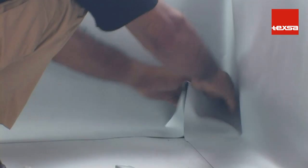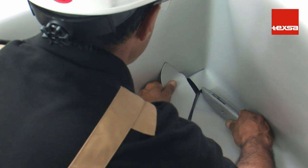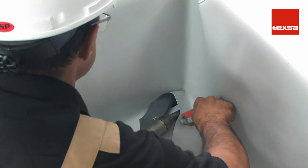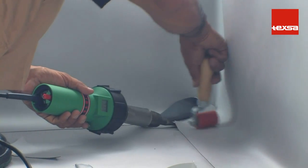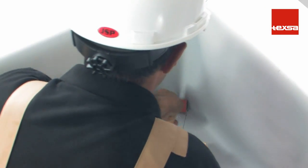Outside and Inside Corners — Lower Inside Corner. First, fit the membrane to the shape of the angle. Cut the fold that forms in the corner and discard the excess. To work comfortably, spot weld the upper wing to hold it in place. Weld the lower wing of the roofing membrane while pressing with the roller. Next, close the fold and weld it from the inside out. Take special care along the vertex.